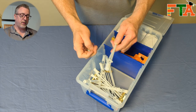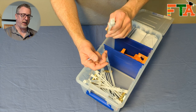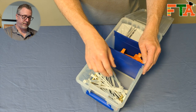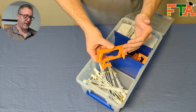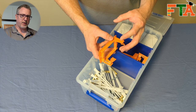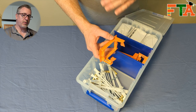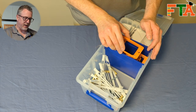If you're not familiar with togglers, hop on YouTube and watch some videos about these. They will hold a tremendous amount of weight and are perfect for mounting TVs and any other kind of heavy-duty equipment. If you do like to use standard drywall brackets, you've got these available — but as you can see, they're very thick and awkward in terms of space consumption. I really prefer the aluminum drywall brackets I showed you before: thin and flat, taking up so much less space. But sometimes it is nice to have this style.